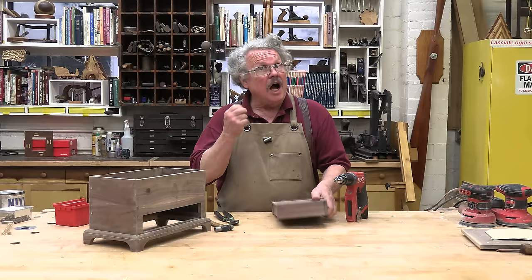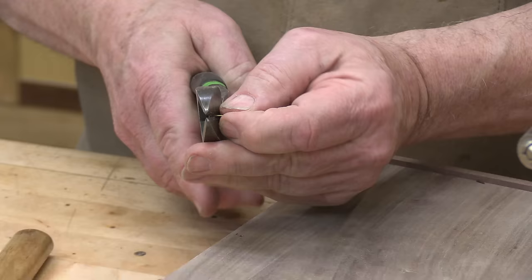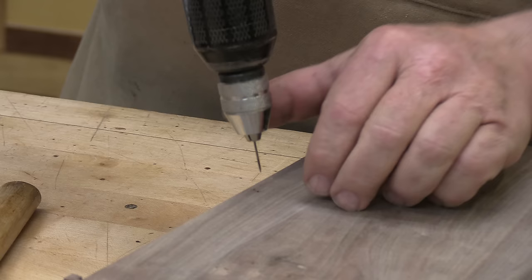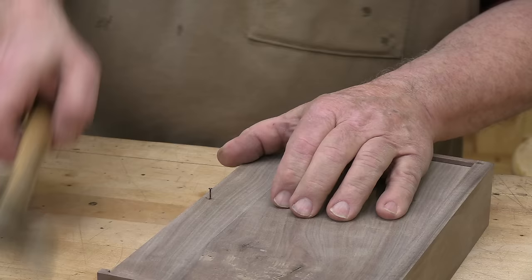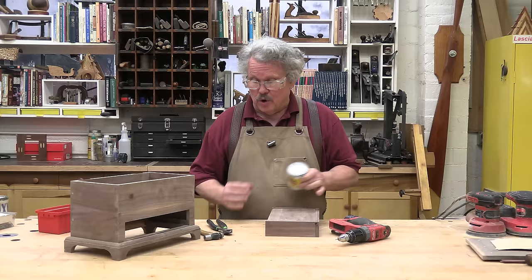Because the back is so thin, you need to be careful when driving the nail — otherwise you might split the wood. So I'm going to spin the nail in. Clip the head off a wire nail and mount it in your drill — you may have to use a special zero chuck to hold something with such a small diameter. Use the nail like a drill bit to make a pilot hole, then tap a headed nail into that pilot hole. I also suggest coating the nail with shellac, as expansion and contraction tends to push the nail out of the wood, and resin-coated nails resist this.